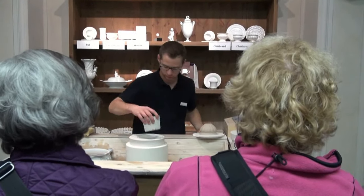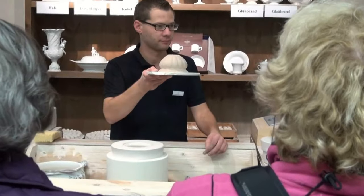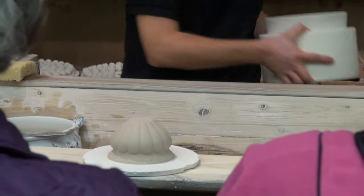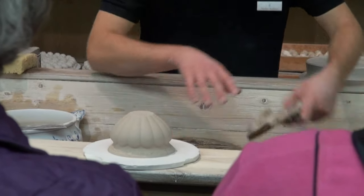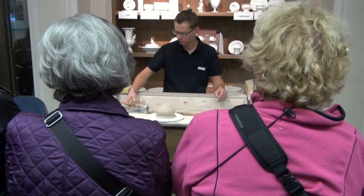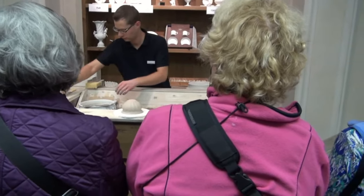At Meissen, Johann Friedrich Böttger introduced the practice of giving the body a first light firing to about 950 degrees Celsius, making an absorbent porcelain biscuit. Our famous factory mark of origin, the blue crossed swords, are generally added to this biscuit. Glazed by dipping in a liquid glaze mixture, the porcelain biscuit is then subjected to a hotter fire at more than 1400 degrees, which is called the gloss or smooth firing of porcelain.